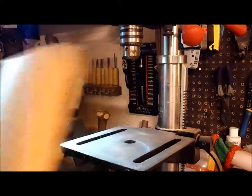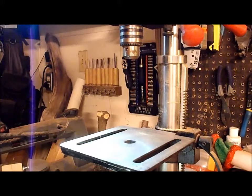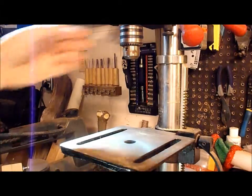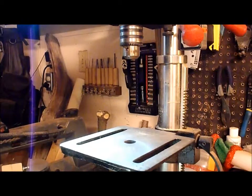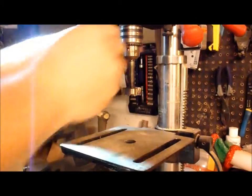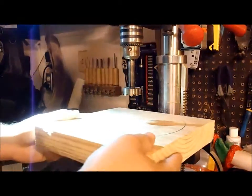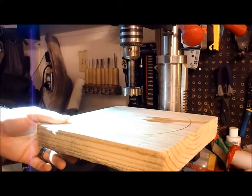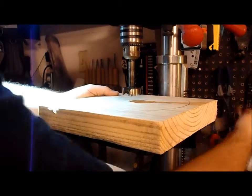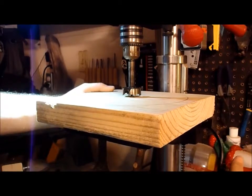Right, so now here we are over at the drill press. I'm sure you've seen one of those before. Grab my Forstner bit. I currently have my pin jaws set up in the lathe, and this 1 3/8 Forstner bit is the largest one I have, so I'm just gonna drill a little inset just for that chuck to grab onto on the lathe. I just wanna drill a big enough inset so I can grab it on the lathe. And still kind of working out how I'm actually going to turn the front portion of it.